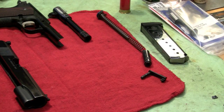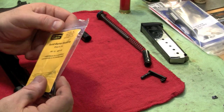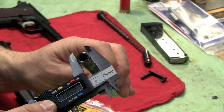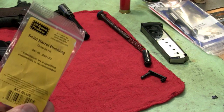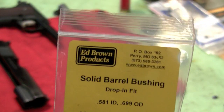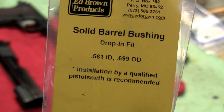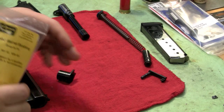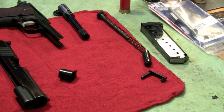The easiest thing to do at that point is call up the nice people at Brownells. They're a huge part supplier for 1911s and other pistols. Tell them what your measurements are. You should also get a measurement at the end of your barrel — they're going to want to know that as well. They'll hook you up with a bushing. In this case I picked an Ed Brown — they make good parts. So there's my inner diameter, outer diameter, solid barrel bushing. It's a drop-in and it's blued. Simple as that. You've got to be willing to take a possible hit that it might not fit and you'll have to visit your gunsmith, but in this case it fits perfectly.